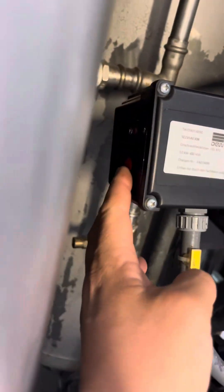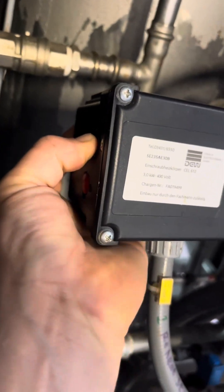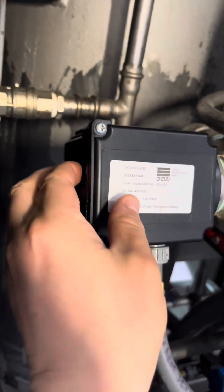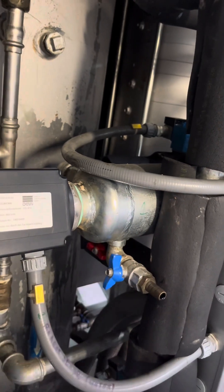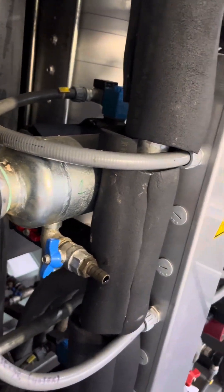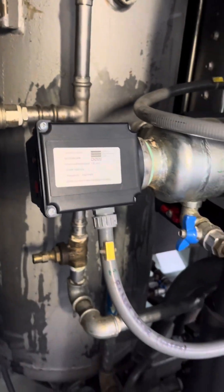On these, you've got a thermal cutout, and that's going to be your first port of call always — nine times out of ten a quick, easy fix. What you want to do is feel the impression in, and if you hear a click and it pushes all the way in, you know it just tripped — could have been an air pocket or something like that. I pop this one in, which it was. That explains why we've got the voltage but no current being pulled.